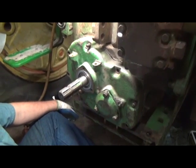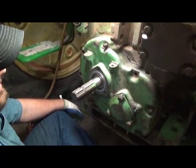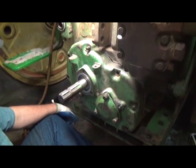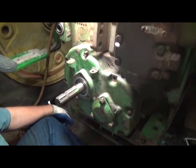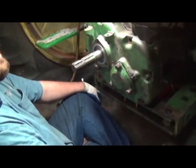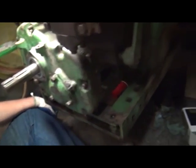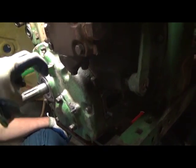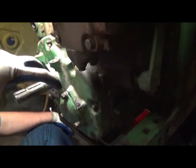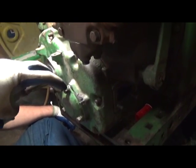It's important to take great care when we're removing the oil seals from the power shaft housing. You definitely want to put them in a vise and make sure your vise is tight. Sometimes it does require a little finagling with either seal removal prying type tools, or driving it from the other side with a blunt chisel or a punch of some sort.